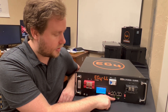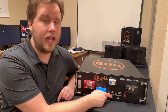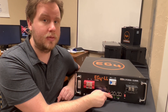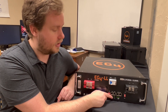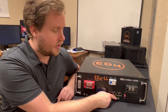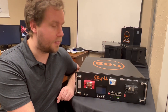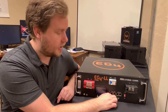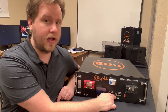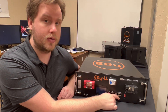Over to the right we've got three sets of lights: the ALM light or alarm light, the run light, and the SOC lights. The ALM light indicates if there's an issue with the current setup that you need to address — those alarm codes can be found inside the software we provide. The run light lets you know if the BMS is running. The SOC lights will light up for each 25% the battery is charged: up to 25%, 50%, 75%, and finally 100% state of charge.